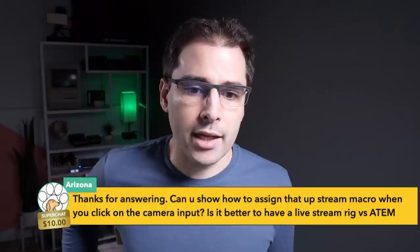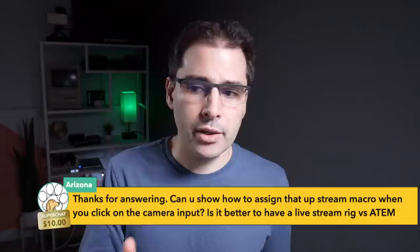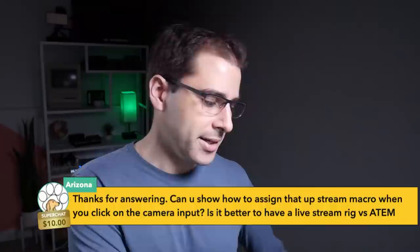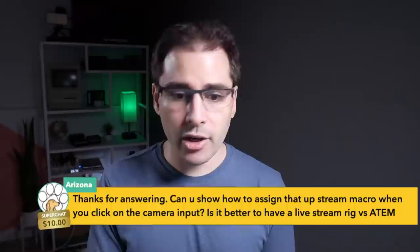And the trick is that when you want to rig something up like that, make it a macro. That way you can get any of those devices to just run a macro. And then anything you can do with the macro, you can then trigger from any button. It's just that you can't use the actual buttons on the ATEM. And this is why I want to be able to reassign those to macros, because then the ATEM Mini with all of its buttons would be a fantastic control surface by itself. But there are lots of good control devices as well anyway.